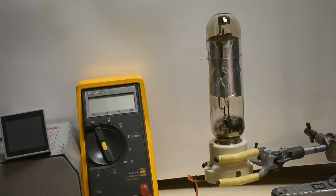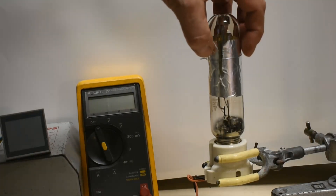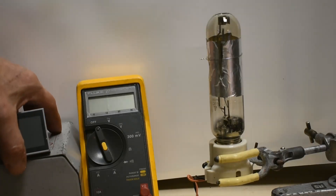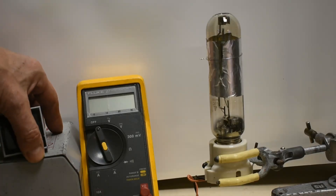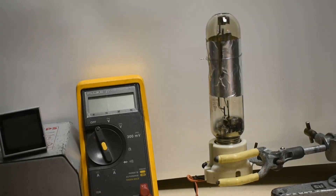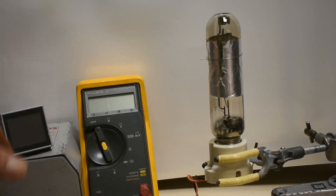We're going to push the pressure even higher and examine what happens to the band and how it broadens. To do that, we've put some aluminium foil around this light to reflect the heat back in and basically try to increase the temperature in the arc. We're also overdriving it with a leak transformer, which is capable of driving the voltage above mains voltage, keeping the current constant and allowing the lamp to be elevated well above mains voltage.